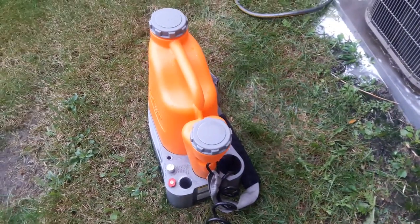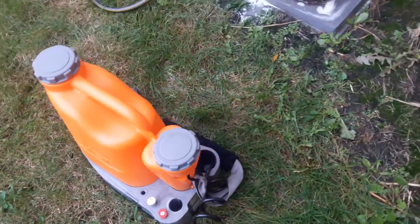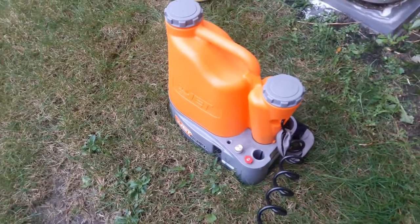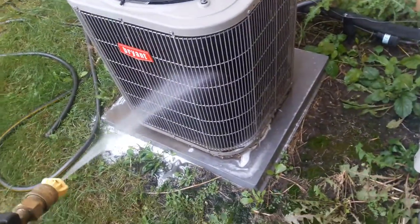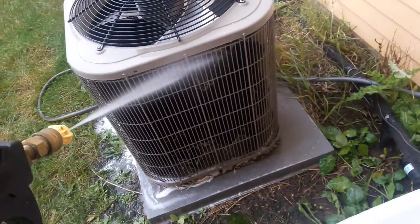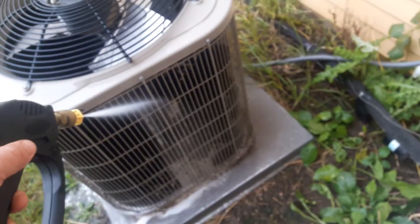It is important to see how much water you have left and to not go dry, because it takes about a minute and a half of spraying to get the prime back in the pump. Also in those ads at Johnstone and stuff they show a guy in fresh clean clothes with this up over his shoulder blasting the coil, but really this thing is like 80 pounds or more when it's full — it's a real bear cat. It's near impossible to get up on a rooftop; I use a rope to be honest. I tried going up with it on my back and I couldn't fit through the scuttle.